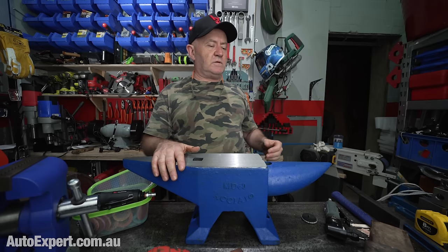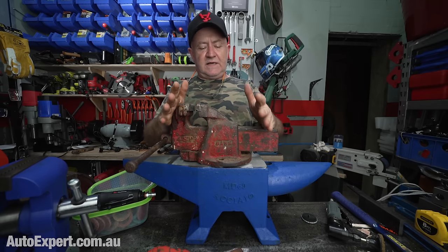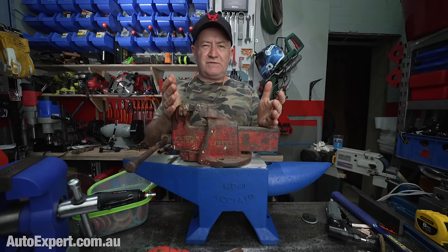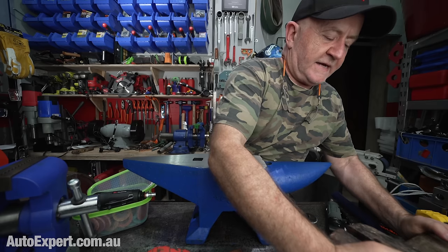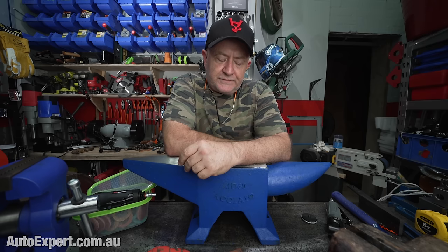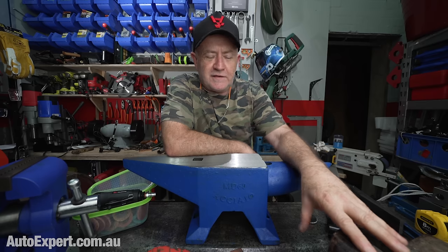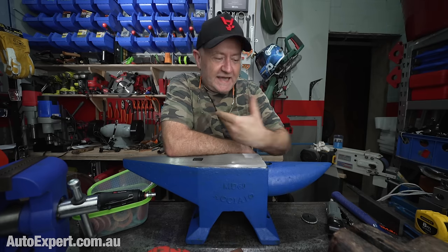And when you think about it, when you look at a vise, even a fairly basic antique Dawn vise like this, I picked this one up the other day and it cost me a couple of $100. If you break it, it's really hard to fix because cast iron doesn't weld. That means if you break it, you'd have to braze it, and you need a lot of heat to braze a big, thick chunk of cast iron. It's going to be as strong as it was, but it's never going to look as good. And it's a pain in the ass doing it. And you'd gut yourself because someone owned that vise for years and managed not to break it by using it as a press or hammering on it excessively, and a ham-fisted dickhead went out and broke it.